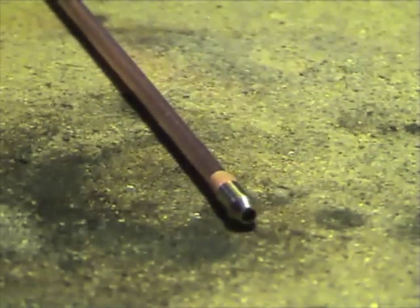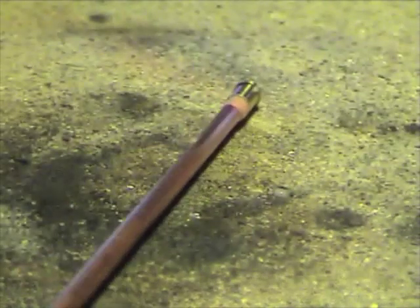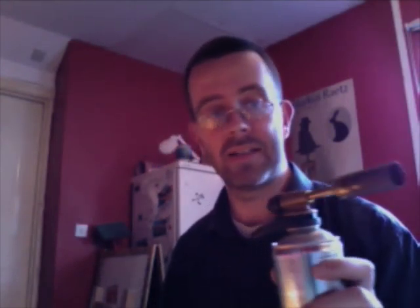Just to make things easier for myself, I'll turn it around so you can see better. Nice and visible — let's not slide it off, I'll just give it a bit more support. The other thing we're going to need is a nice blowtorch. This is a fairly standard butane-propane plumber's torch and that will do the job nicely, plus a lighter to light it with. Here is my silver soldering wire, and I'm just going to put a little bit of flux on the end of that just to coat it a little bit — that makes things just a tiny bit easier.